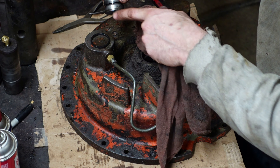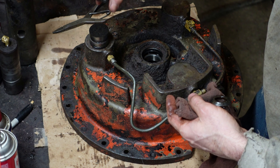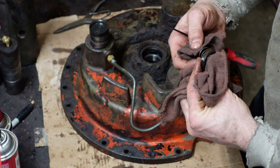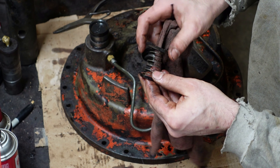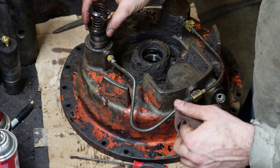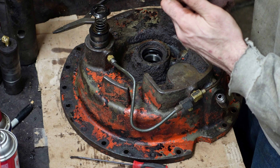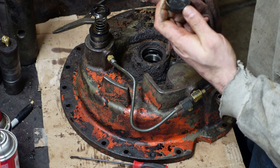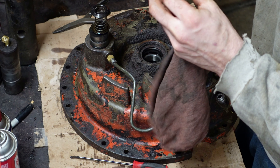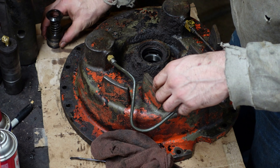So we've got piston, O-ring on the piston — that's probably to keep the oil from the transmission from getting in — and a cup seal, that's to keep the brake fluid out of the piston. And there's a spring with little steel ends to it, a little return spring. So that's a pretty simple setup and this all looks pretty good. This stuff looks like I could reuse it — we'll see if the others are as good. I'd like to replace these and I'll see if I can get a kit. If not, I think these would work. The problem is if they fail, it puts brake fluid in my transmission, which is not very good. So I'll try to replace those.